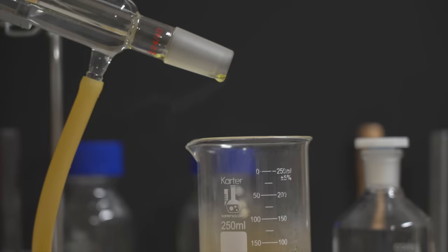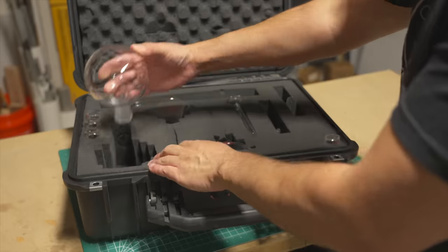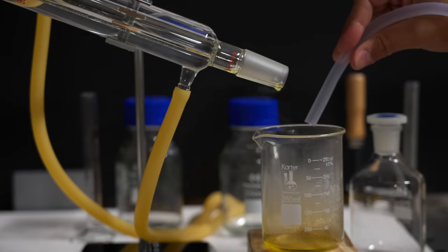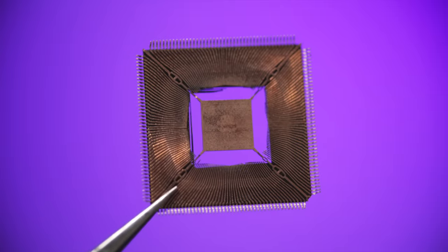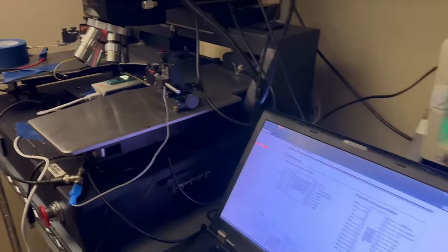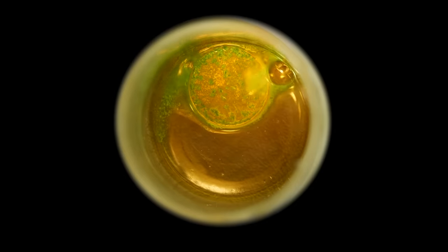You only need to shop for fuming nitric acid online for a little while to know it's incredibly expensive, even in small quantities. Literally all this glassware was the cost of one small purchase of fuming nitric acid. It's called fuming nitric acid because when I blow some air on it through this tube, it fumes. This stuff is the real deal — it'll eat through a microchip package no problem. It's also handy for reverse engineering because the more concentrated nitric acid is, the less likely it is to attack metals like the tiny wires used to connect the bond pads from the silicon to the lead frame. This is good if you plan to power on the chip after decapping to directly probe the silicon.